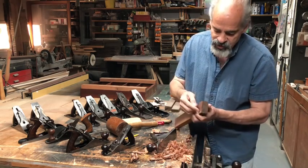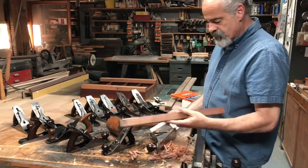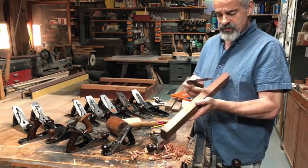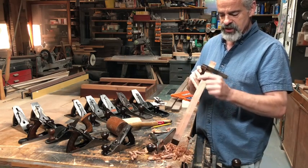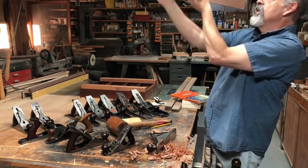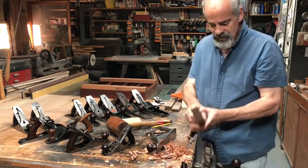The next step is to put a square on this and make sure the two faces are correct — if it's out of square, now's the time to adjust. I take the body of my square and put it against that first side, then test this edge. Rather than adjust the wide side I'll adjust this thin edge to make sure it's square to that one. I sight it out toward the window for light and I can see that this side here is about a sixteenth of an inch higher than this side. So this side needs to come down.